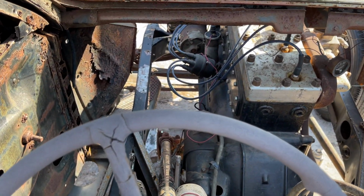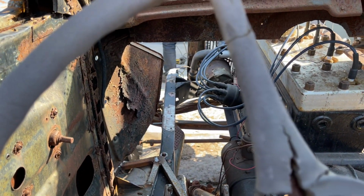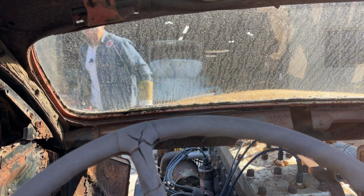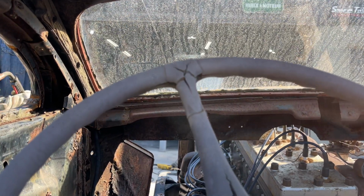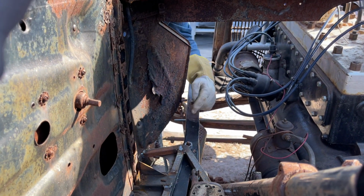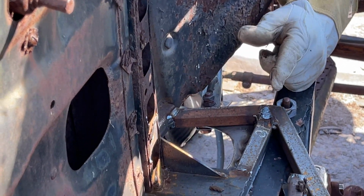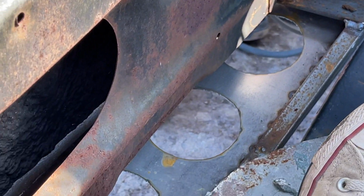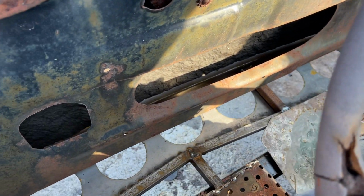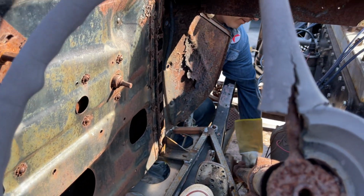All right, you're gonna hold her up where you want her. I'm gonna, oh, I didn't even plug this bad boy in yet. Took the cord. All righty, we've got blast off. You can show them how we finished the bottom, like all the stuff here where I clamped the ground on. We've got this all square tube now from the skeleton to the outside square tubing. In the middle of the doors, there's another one. Back in by the B-pillar, a little closer, there's another one. Right back to the inner wheel well, which ties that body in really nice.